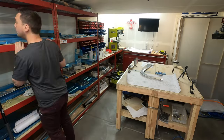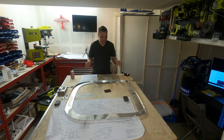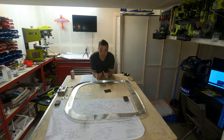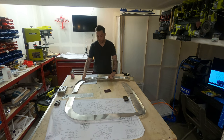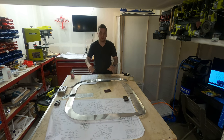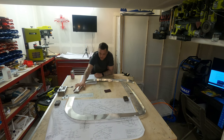So with that, I'm going to get to it and start pulling parts. The first step here, we've got to get these flanges set at an angle, get the bulkheads fluted so they lay flat, and then start to work on them. This is the bulkhead — it's nearly as big as the firewall, and it's the biggest bulkhead out of the tail section. Obviously we're starting from the front and it tapers as it goes down. Keeping that taper in mind when we adjust the flanges, all the flanges on these bulkheads point forward, so we don't want a 90 degree angle — we want to match that same taper. Coincidentally they're already bent out a bit, which tends to be the case; they're not fully formed to a 90 and you've got to push them in that direction, so they're probably pretty good where they're at.